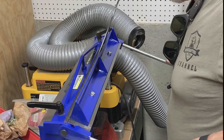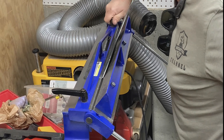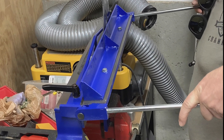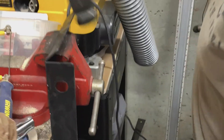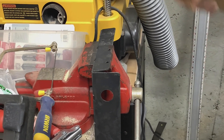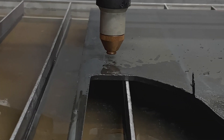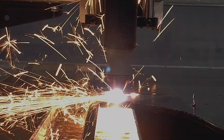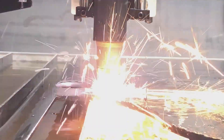Here I am bending the second brackets. I don't even actually have video of the cuts. We put in some relief cuts so that we could bend these on my brake — the brake I was using is an Eastwood and it's really only supposed to bend like 16 gauge. So what we did is basically leave about an inch and a half along the entire bend, so it was bending very little. That particular shot I was hammering it, but on the second bracket I got a little bit better finesse.